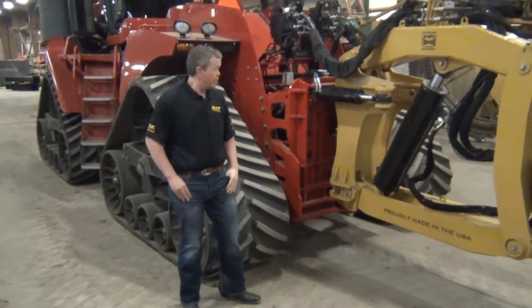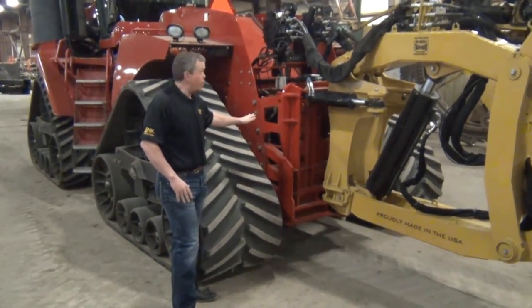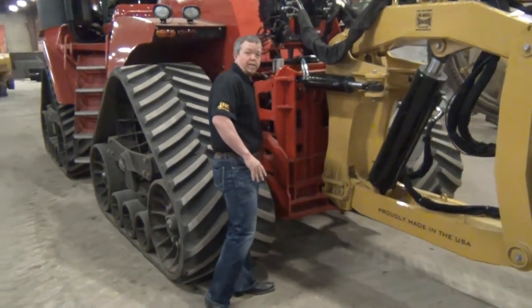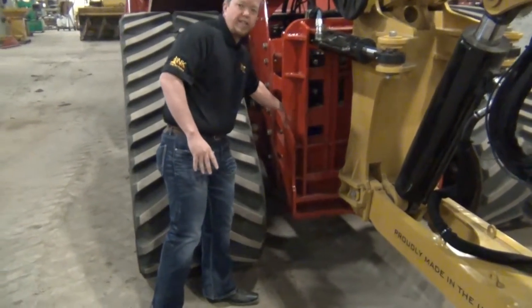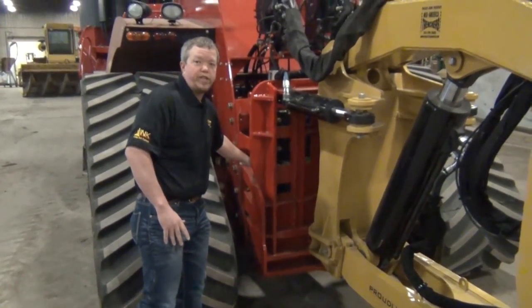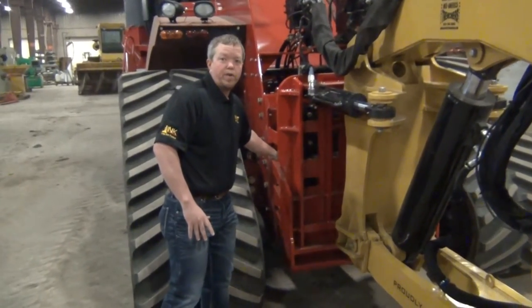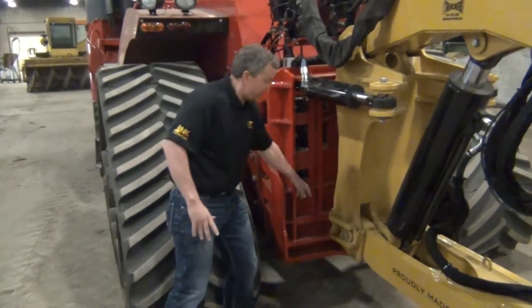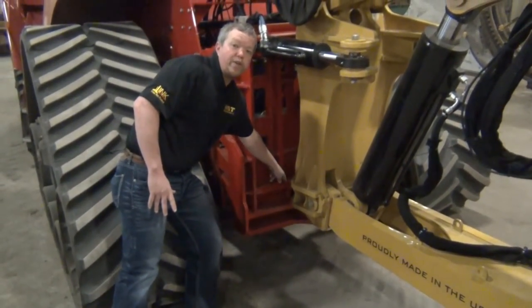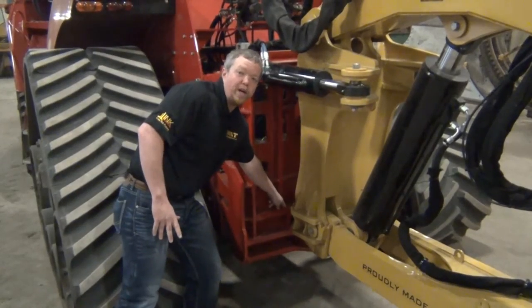Let's talk about the custom mounting job we did. When this tractor came in, it had the factory drawbar in it, valve stack in the normal position. We designed our mounting plate around all of that. As you can see, we're holding in the standard bolt holes along the back of the 580. We have a custom drawbar underneath the tractor — we pin into the original drawbar position, then we manufacture and machine fit a drawbar to this mounting plate so your force of the pull of the plow is going back into the drawbar. Wherever the main link is for the bottom pull, through the front side of the mounting plate, we'll have a clevis hookup. So if you're going to put a pull tractor on this, you can pin your cable right to the mounting plate so you're not putting all that extra pry back through your tractor — you're putting it through the mounting plate, pulling it on the plow where it belongs.